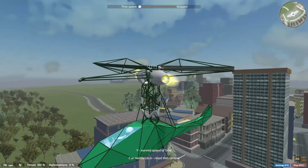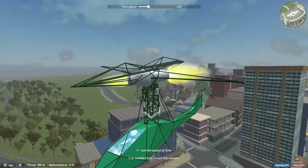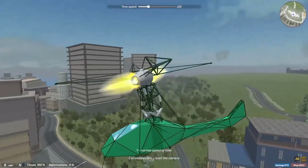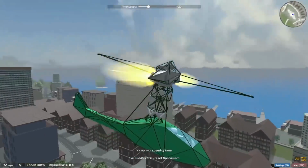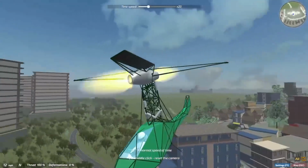And after I did that and waited for a second for the forwards movement to finish doing its thing, you can see the pitch of the blade is actually varying during flight. It reaches its greatest extent on the left side of the helicopter, and its lowest on the right side. And you can see it's actually a pretty similar story for moving left and right, except the pitch of the blade reached its greatest extent on the front of the helicopter, and its lowest in the back.